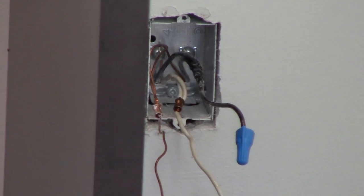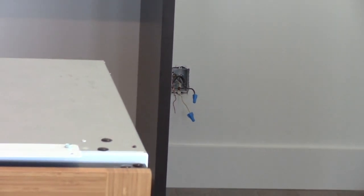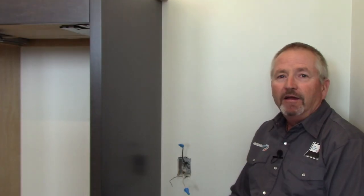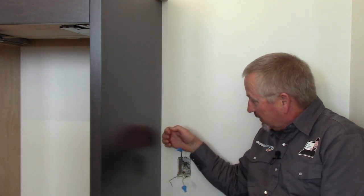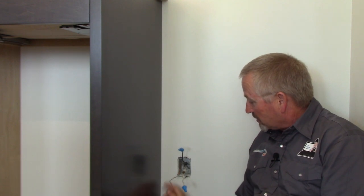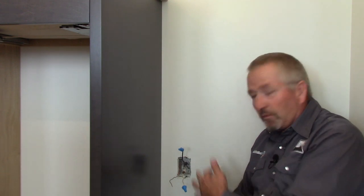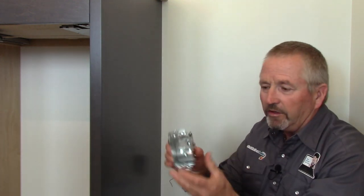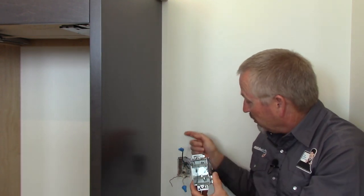From behind the camera I'll show you a close-up of what we've got. The outlet box in the corner has power feed in and power leaving. They've only done a crimp connection with Buchanan-type connectors because the wires were too short, but we're going to fix that — make a proper splice and pigtail to that outlet, then add a two-wire cable and fish it into the cabinet where the fridge goes. First I'm going to shut off the power.